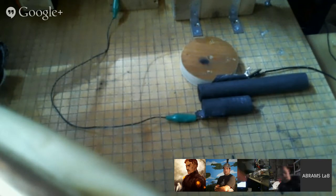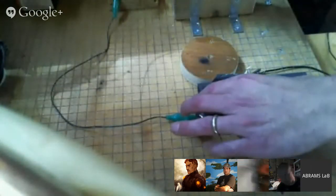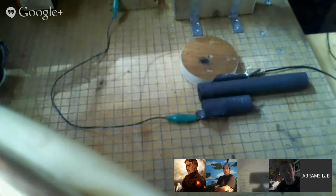So it's 145 watts at 9 kV NST, and it was 1.5 amps, but it's 30 milliamps on the short. Like when you short it, it's supposed to decrease to 30 milliamps, so it doesn't kill you, right? That's the point of the case grounding. But then, yeah, kind of pointless.